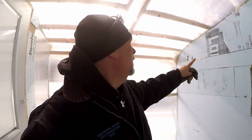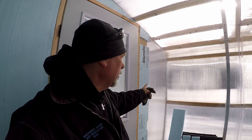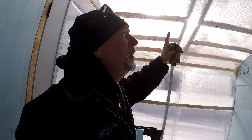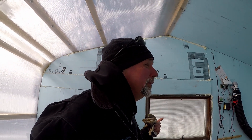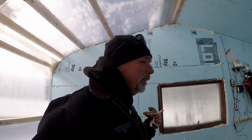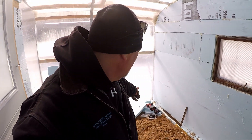The front is just eight feet wide to the ground, and this far corner has polycarbonate panels that we put in double — so there's two inches in between them, an outside layer and an inside layer, and one window we put in. The main structure is actually a tube steel carport that we took apart and used as the main frame to build the structure. We put styrofoam all along the bottom to seal off the bottom sill.